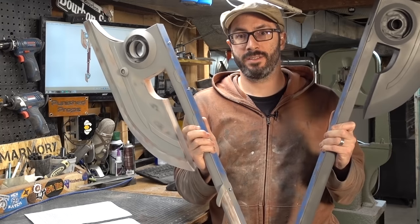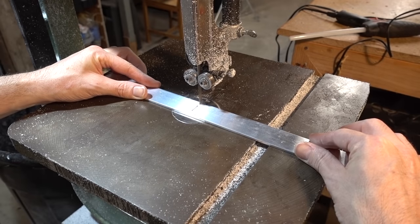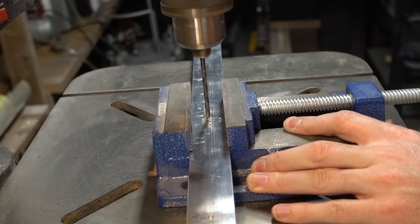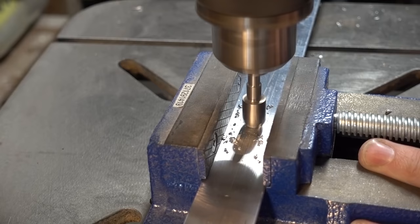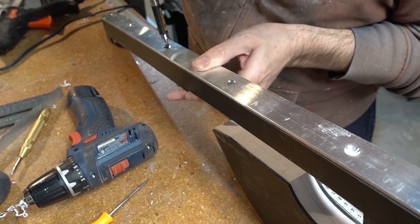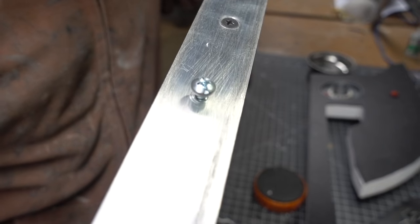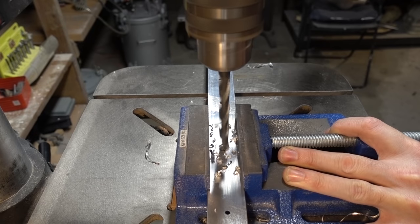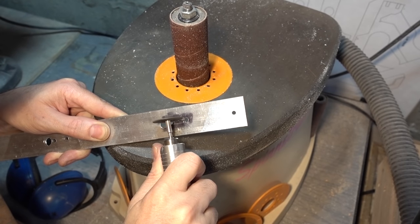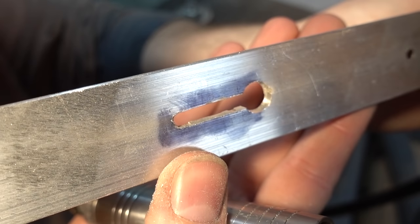To make these guys attach nice and securely, I wanted to use something other than PVC foam, so I went with aluminum. These aluminum strips were an eighth of an inch thick. I cut them to length on the bandsaw, plotted out where the screw holes would need to go, drilled and beveled those holes on the drill press, and then screwed them down to the spine of each axe half. One half had screws that protruded from the spine to make the male end of the connection. The other half had corresponding female keyholes machined into the aluminum strip — basically I drilled a couple of different size holes and connected them using a cutoff wheel on my Dremel tool. These slots let me attach the two halves with a simple sliding motion.